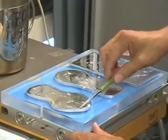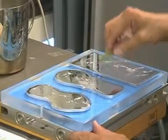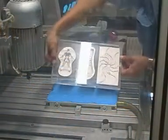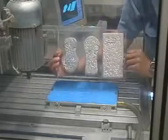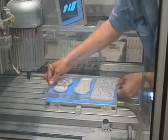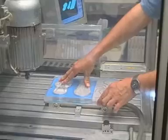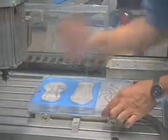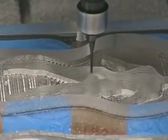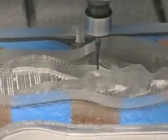Spreading out the LM70 molding fluid evenly into complex parts. When LM70 has solidified, it is fixed with the second side up onto the VAC mat using positioning pins to find the correct position. The second side is milled out in Z, and you can see that the workpiece is only held embedded in the LM70 molding material.